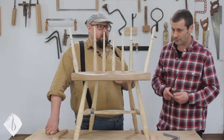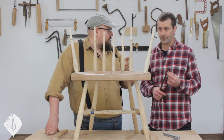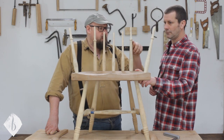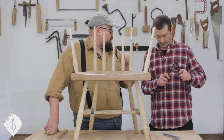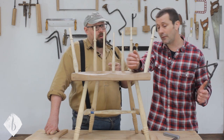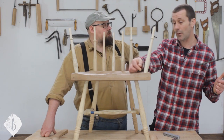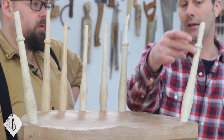We've got two measurements. The back post is eight and a quarter inches — that's from the flat surface up to the bottom of the bead — and that's the same all the way around because these go in at 90 degrees. For the arm post, the measurement is eight and a half inches, and we do it on the longest side. Where your sight line comes out is the longest side, and it's that measurement, because it's quite different to the other side.